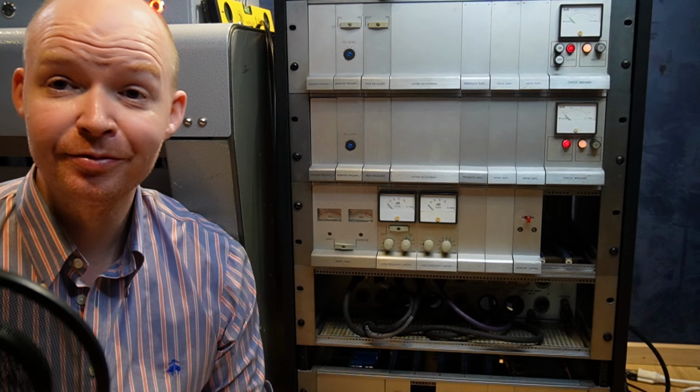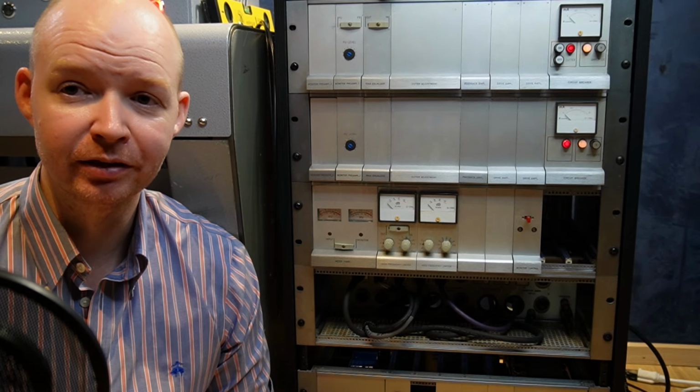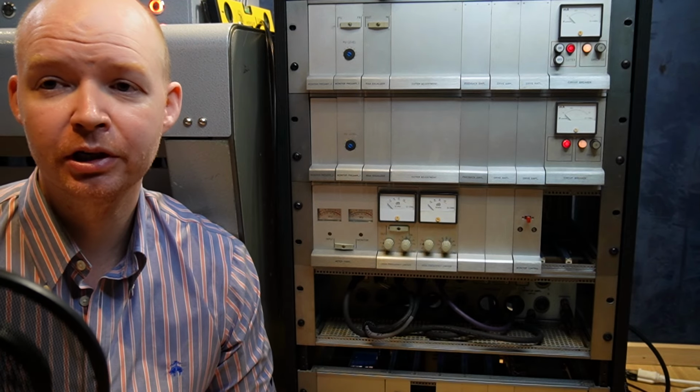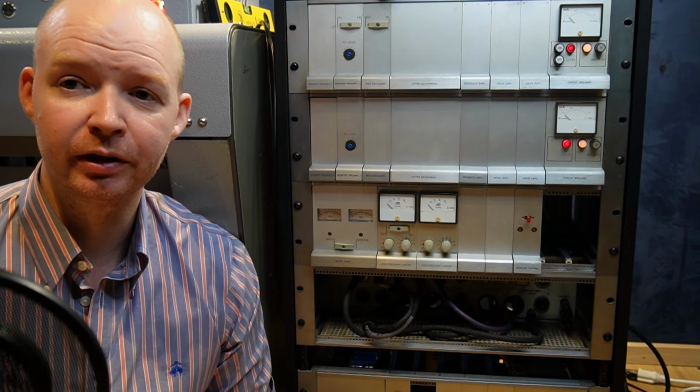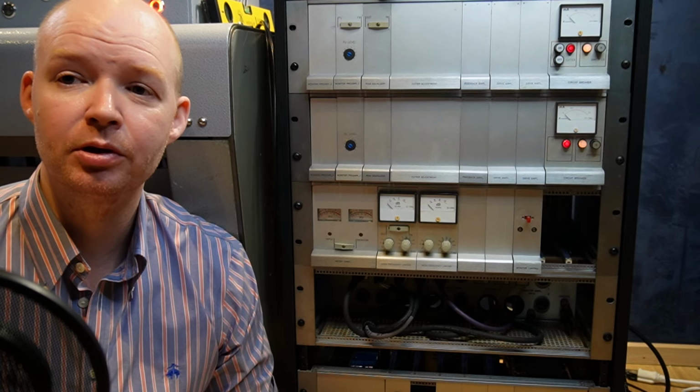In the late 90s, every other cut was a dance music EP that had to be cut really loud to fit in with everybody else. But for better or worse, nobody really plays vinyl at clubs anymore, so unless someone specifically asks for it, I would usually ease off on the cutting level and try to avoid using the limiter as much as possible.